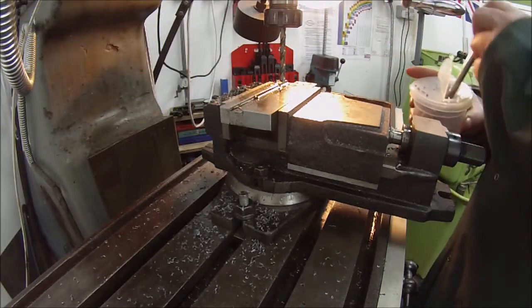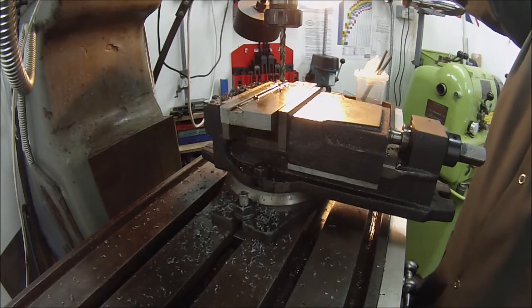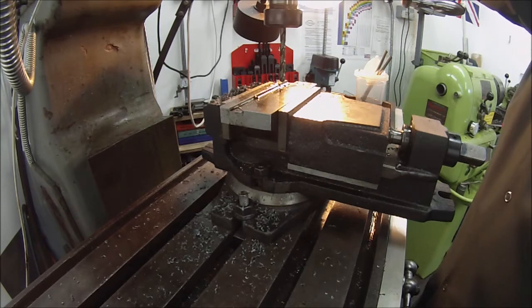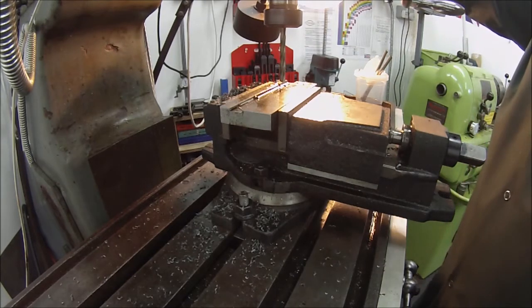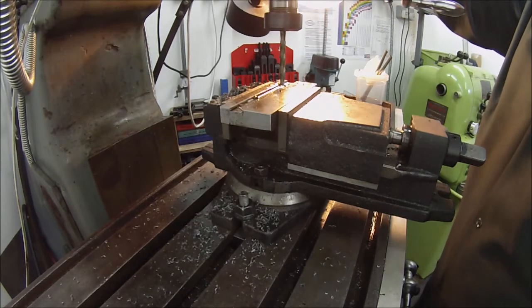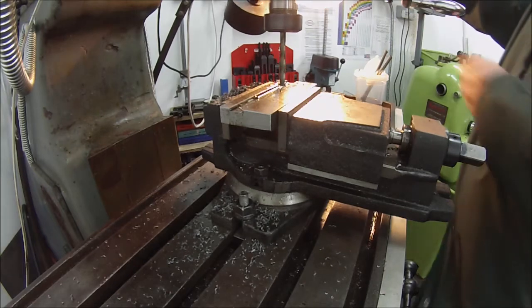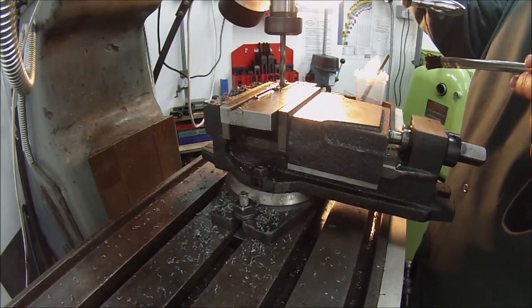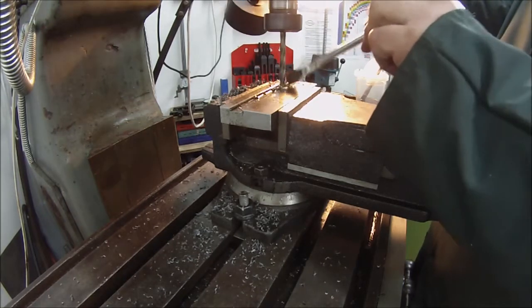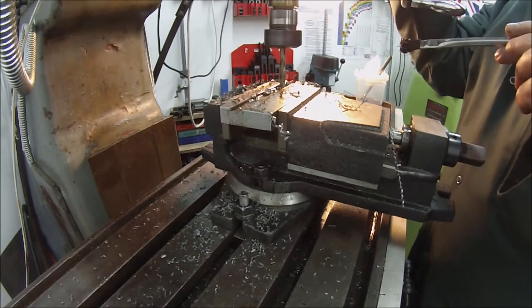Right, our next hole along is in the centre of one of our pieces. Remember, this is both bits still stuck together, and it's at 32.5mm. Look if I go the right way. And I'm going to strike in with a split point drill bit here, so we should just carefully peck at it to get us a start. And that's it. And this is a 6.5 as a clearance for our quarter T-bolt. That's just through.